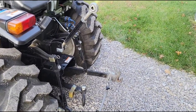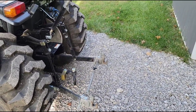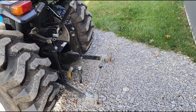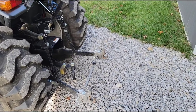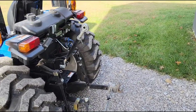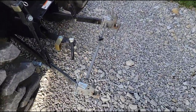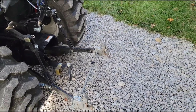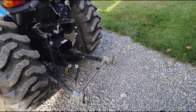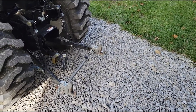I'm not so lazy that I won't get off the tractor. I was basically sick and tired of having to fool with the bottom pins because they never did want to line up right — it took some trial and error and was kind of annoying. The PAT system eliminates that big problem with the two bottom pins, makes it a piece of cake, and then I can just jump off the tractor fast and do the upper one. Working out really good, so I highly recommend these. I noticed there is an off-brand version you can buy — I've seen them at Rural King — but I'd recommend getting the PAT's brand.